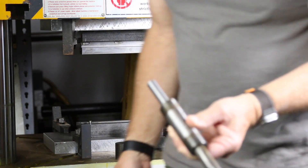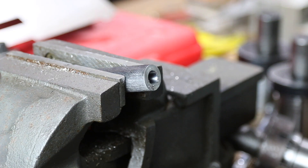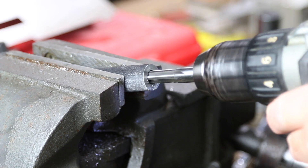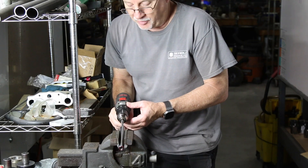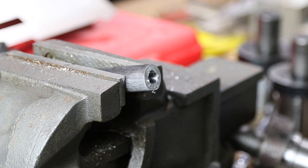I'm going to beat it out with a hammer the rest of the way. Very cool. I know, I should be embarrassed — I shouldn't even show this — but sometimes you got to do what you got to do. And this actually works; it's not that horrible as long as you hold the drill pretty steady. Don't go too fast. I do use oil here, and of course you've got to blow the chips out every few seconds. Put more oil on the reamer. It's not exactly fast, but it does the job.